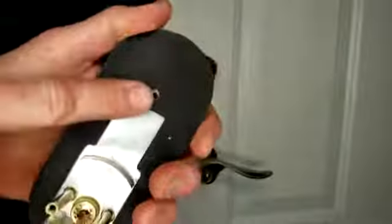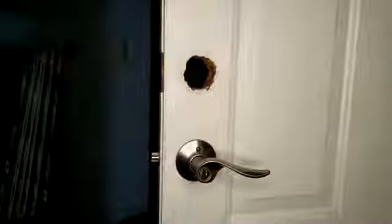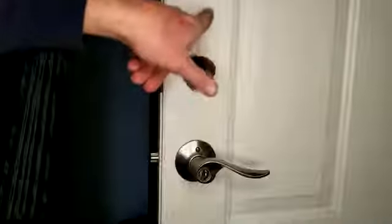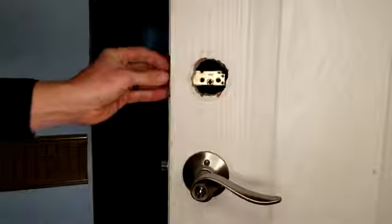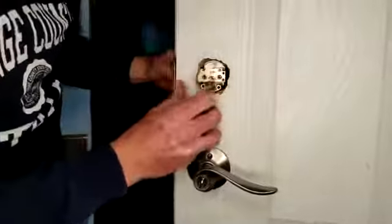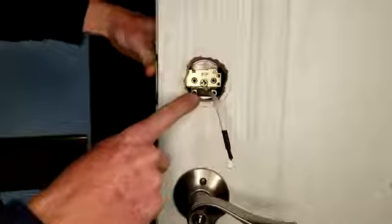I'm not going to use that top bolt because I'm eventually replacing this door. I've reviewed other smart locks before — just using the bolts down here, it's secure and firm. Obviously the third bolt would be even better, but that requires drilling into the area with the template above the deadbolt hole. So back inserts the deadbolt, the front portion, the wire goes underneath, and then you have your little turnkey knob that fits right down the middle. Your two gold screws go right through here — that's why I enlarged my circle so the bracket comes in down below.